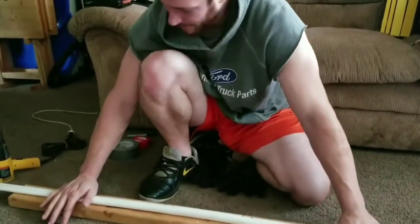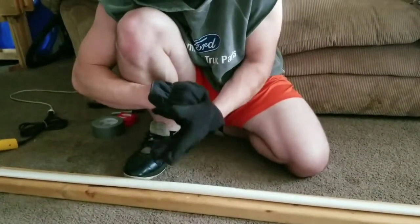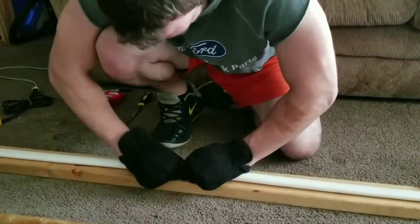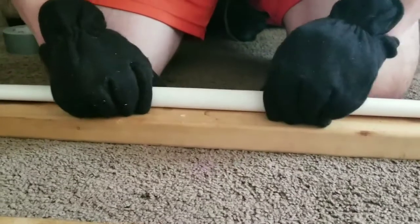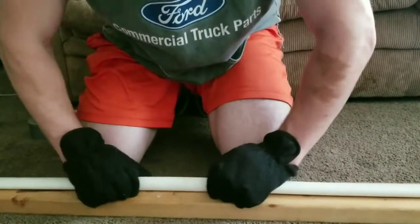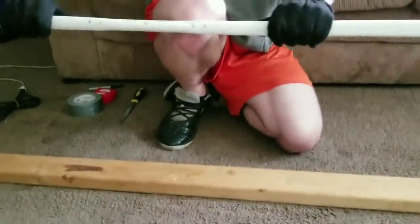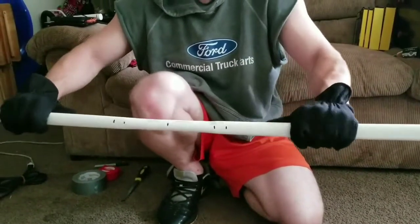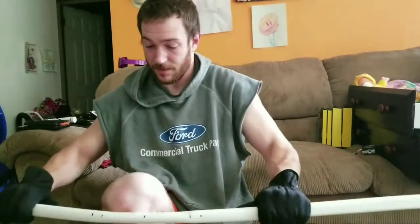At this stage I want to make sure the limbs are flat while the handle section gets squished upward as much as it can. I'm trying to keep the limbs as flat as possible while heating. The duct tape will probably melt quite a bit, but the shape of the pipe will keep those rods in a bundle, so you don't have to worry too much about it. I'll keep flexing it forward over my knee to make sure we end up with a slight reflex in the handle.